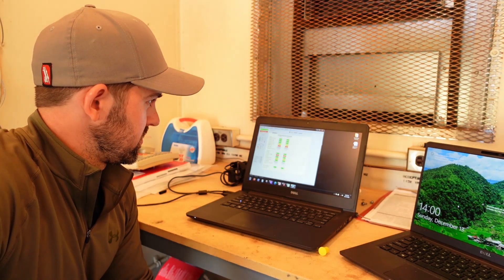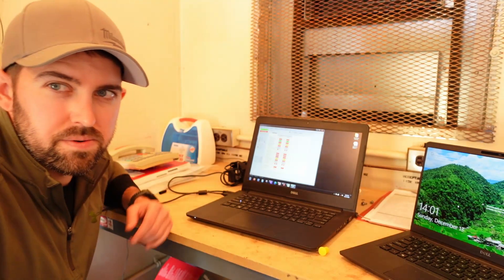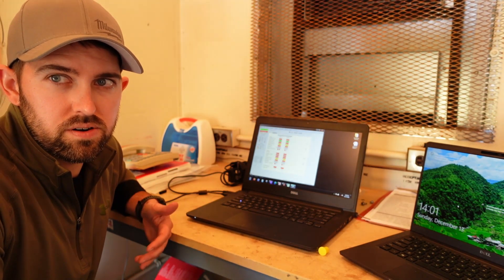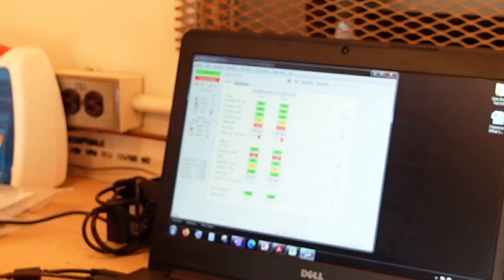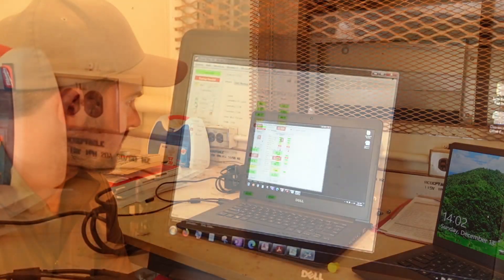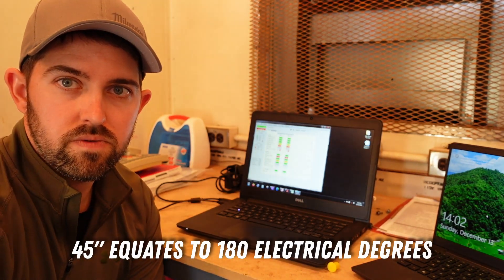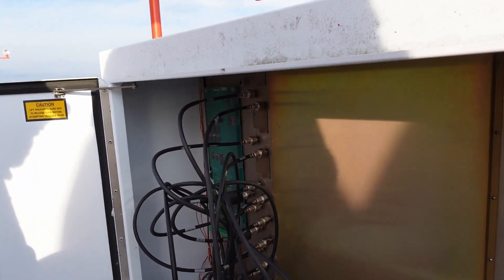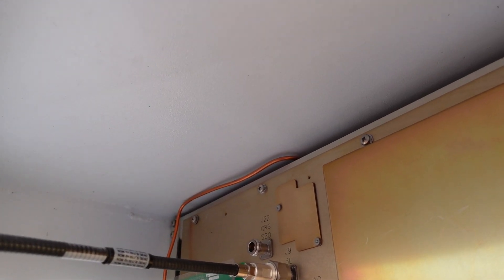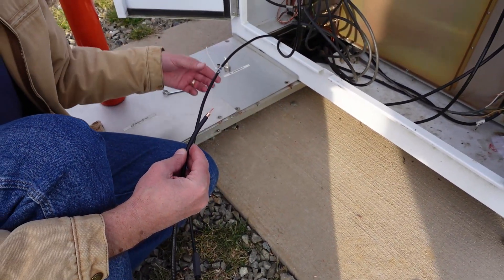So now we're going to take the quad cable out and make sure that we're not reverse sensed. I have a feeling from earlier that this looked to be reverse sensed. When I say reverse sensed, I mean we're expecting to read 155 DDM in the 150 Hz side. Reverse sensed would be if we read 155 in the 90. We took the quad cable out and we're measuring 102 in the 90, so we're definitely reverse sensed. We're going to turn up our width DDM pot on the MRU to make that read 155. So we're reverse sensed — not a big deal. We're just going to cut 45 inches out of either the SBO or CSB feed line out in the DU. We're here at the distribution unit box on the combining unit side, and we've disconnected the SBO cable from the course SBO output of the CU. We've got plenty of length on that cable and we're going to cut 45 inches out of it to correct the reverse sensed issue.